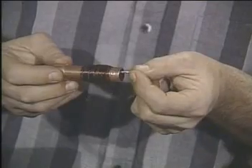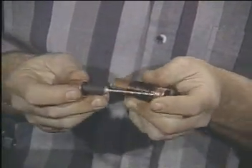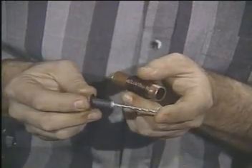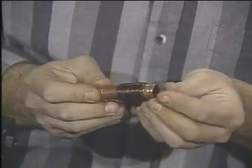That's how a speaker changes wiggling electric currents into wiggles in the air that your ear can hear. The same speaker will also generate a wiggling electric current if I talk into it — a lot of microphones use that principle. Here's a phonograph cartridge I made myself; it also uses the electromagnetic effect. It's got a needle-like object — a nail in this one — glued to a magnet, and the magnet is attached to a piece of floppy material that lets the entire assembly move. The needle and magnet are inside a coil of wire. If the needle drags through a wiggly groove on a phonograph record, it will generate a wiggling electric current that matches the wiggles on the record.